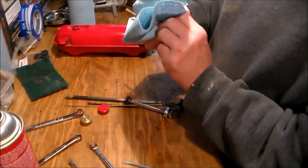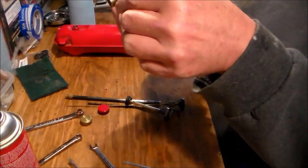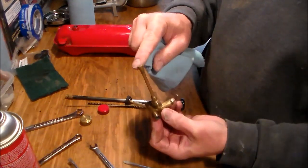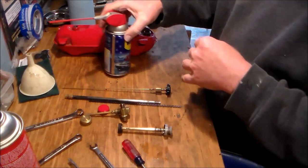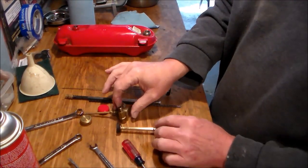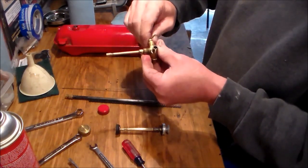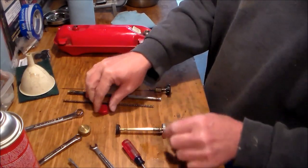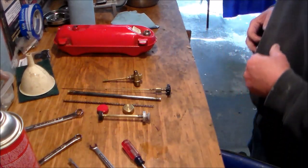That's all you're doing on the inside there — just cleaning, then remove the fuel suction valve line, clean that rod inside it, and make sure the nozzle is clean and put it back. That's the maintenance — we've cleaned the valve, we've cleaned the lighter and run valve, reassembled it. Everything else is done: got the caps done, pump's done, it's ready to go back together.